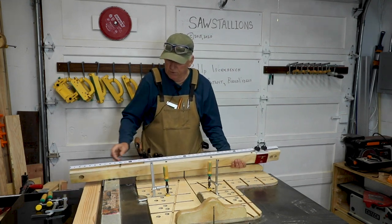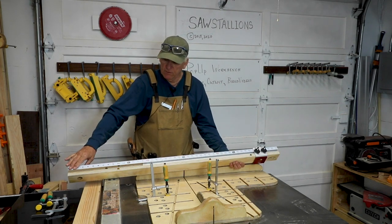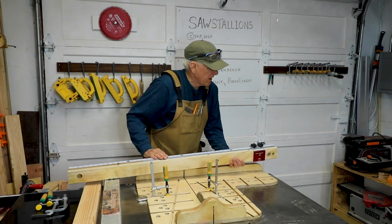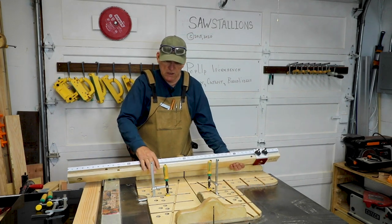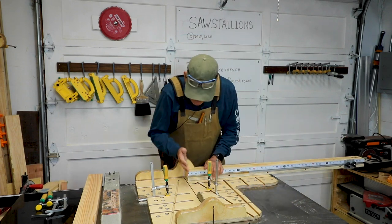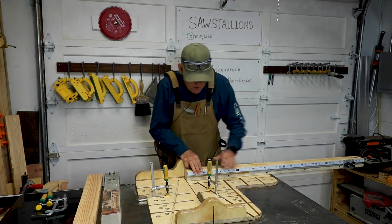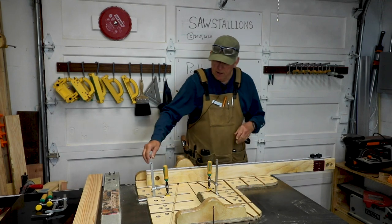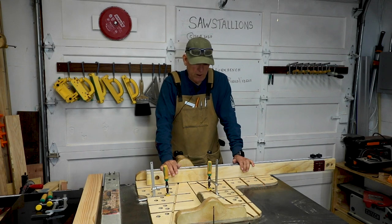The other thing I did was I took a rule from FastCap — they sell that with two-sided tape. I took about 45 to 47 inches of that and I put it down on this sled, then cut it right at the zero spot. I edged up and edged up to that until I could put down my measuring tape and see that it was accurate all the way along — kind of a little calibrating.